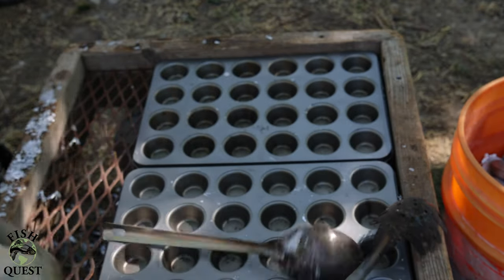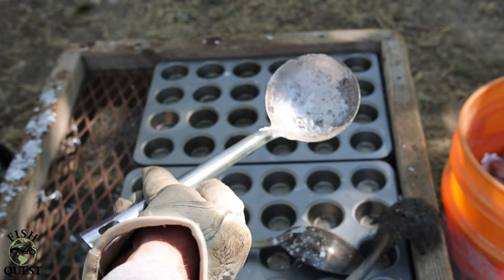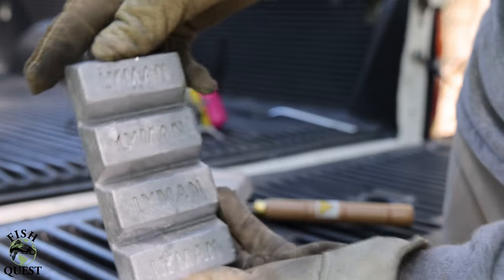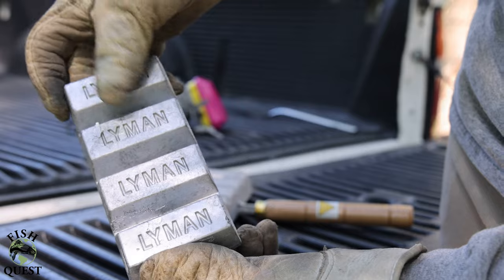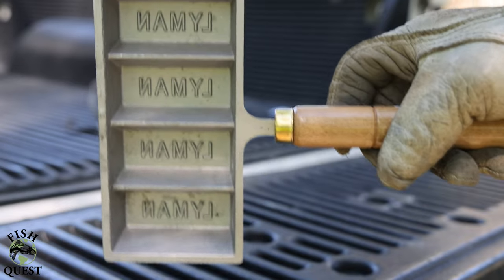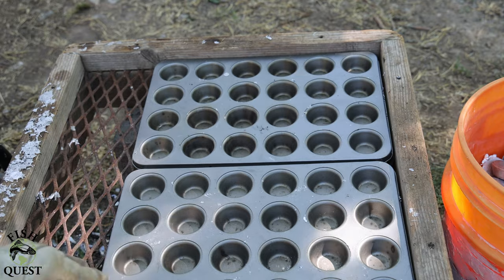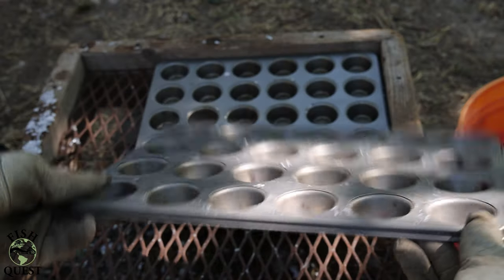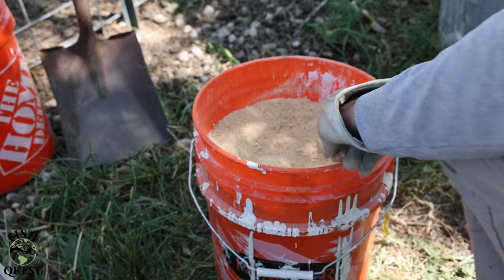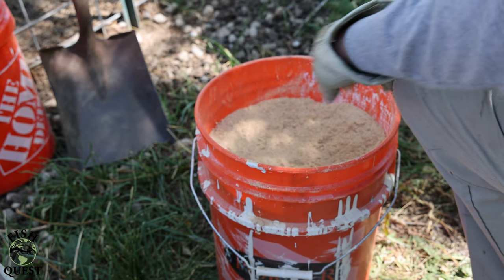You'll also need a stainless steel ladle for pouring your clean lead into the molds. All three of those utensils can be picked up at Walmart on the cooking aisle. You'll need a mold to pour your lead into — they make molds specifically designed for lead pouring, however they're not necessary. I like to use mini muffin tins: they're readily available, cheap, and do an amazing job. I'm basically just looking to store my lead. You'll also need a form of flux — I use sawdust. We'll get into what fluxing is later in the video.